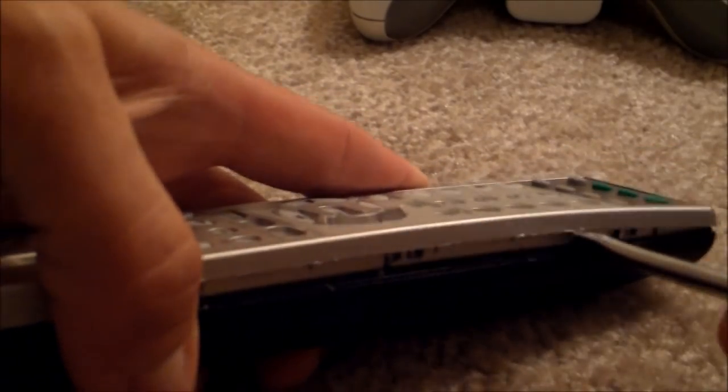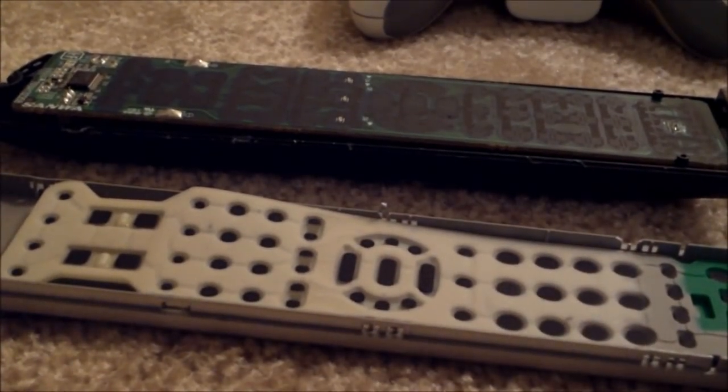So let's go ahead and get started. Take out the batteries. Let's say the circuit board's cracked or you're not getting the light. First things first, we want to make sure the circuit board is working. We're going to clean the circuit board and do a number of things. Once you take out the batteries, stick your screwdriver in here — flathead — and go ahead and pry it all open. It's all clips. Put it face down. There's the circuit board right there.